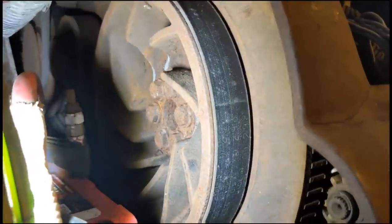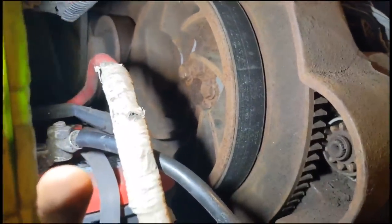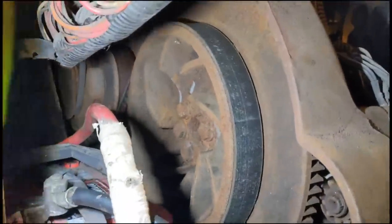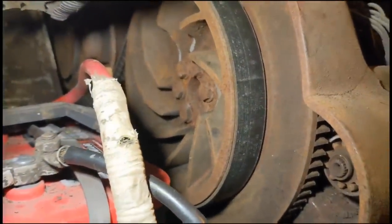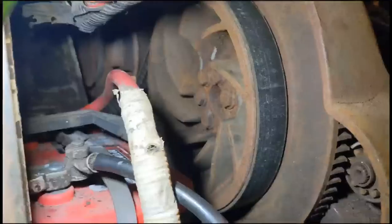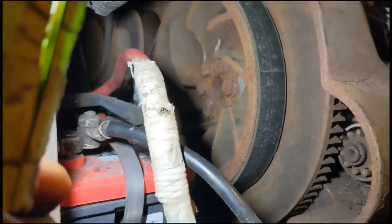That's a battery bodged in there. It's nice and tight. Solid as a rock. Only thing I'm concerned about, I broke a few of these cooling fins on the flywheel when I was trying to break it free. They're on one side, so I'd have a little concern about the imbalance in the flywheel. So what I might do to rectify that is just as rough and break some off the opposite side. Should stop any imbalance. Don't think it's super critical, but a little bodge, easy to rectify.